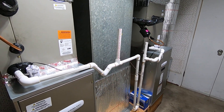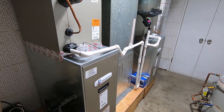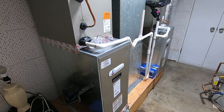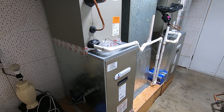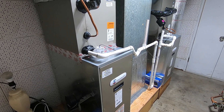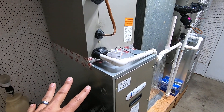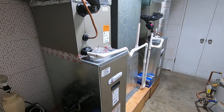When you are heating and cooling, these units will be on. Before, when you were heating, it was just a gas furnace doing the heating with gas. Now that you have a heat pump condenser, the outdoor heat pump condenser will be on in heating mode as well as these indoor blowers — all at the same time to accomplish the heating. And obviously for cooling, they're all on too.